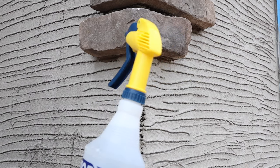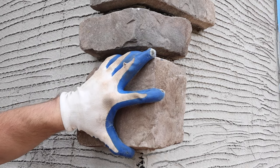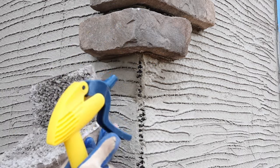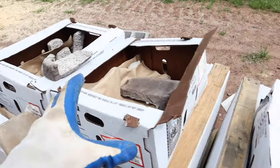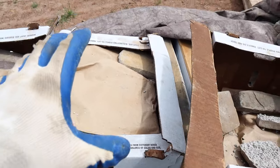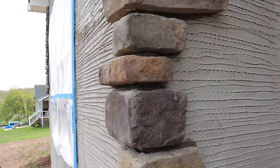Something else I wanted to show you: if it's really dry out, get a spray bottle full of water and spray your scratch coat and spray the stone. Sometimes it's so dry that you'll lather up the back of a stone, stick it to the wall, and it just soaks the moisture right out of the mortar really quickly. I always recommend carrying a spray bottle full of water so you can work when it's really dry out. Also, before you start your stone veneer — for both corners and flats — I have six different boxes of corners and they all have different shades of color. Grab corners from each box so you get a variety of colors, because you don't want them all one color and then suddenly switch to a totally different color.